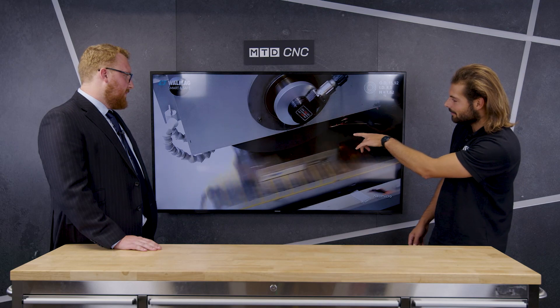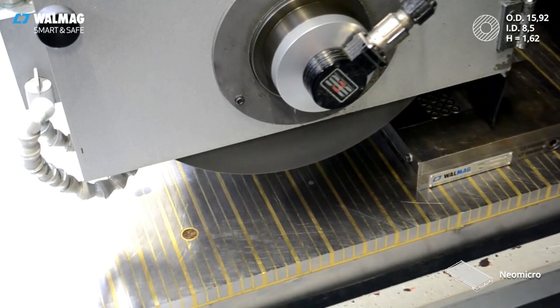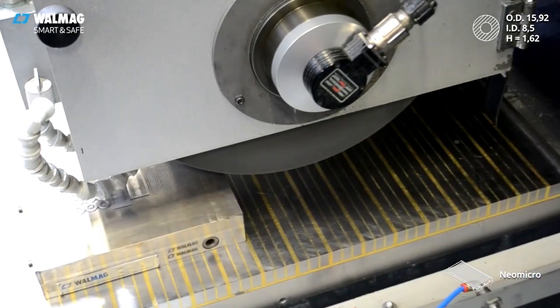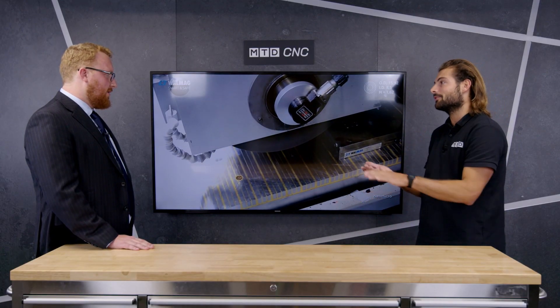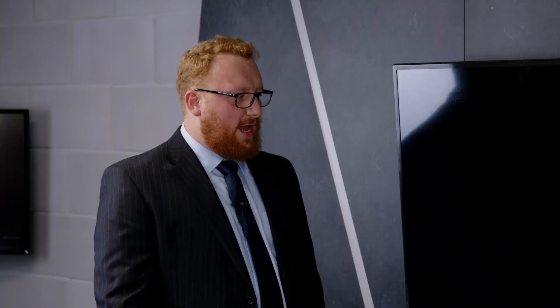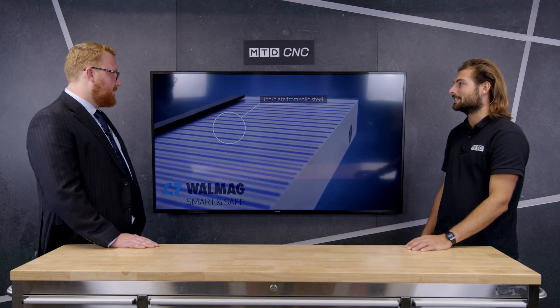Also, we can see right now you've got some quite small parts on the mag base that you're surface grinding. Obviously it lends itself to surface grinding as well. My personal experience is in milling mostly, but surface grinding — if you want accurate flats on parts and you can't hold those with a vice, you need a mag base. Definitely. And with the bases, they've all got a grinding allowance to them as well, so they can actually be ground on the machine bed to ensure that you're getting that exact flatness that you're looking for. Which is obviously what you need if you're surface grinding.